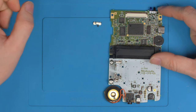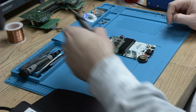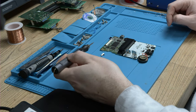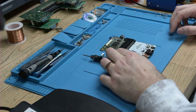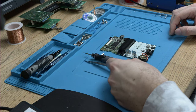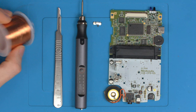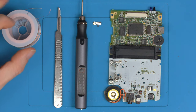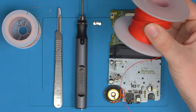In order to repair the damaged traces, you really want to expose fresh copper and cut traces and scrape things. For that we're going to want ideally a PCB grinder — basically just a small tool that can grind away at the circuit board. We also need a scalpel, which can replace the grinder if you don't have one. We're going to need some enamel wire — I've got 0.2mm enamel wire here — and that will be for repairing where the traces are ripped.